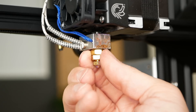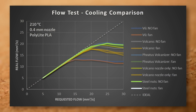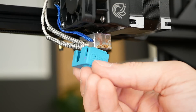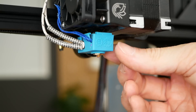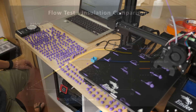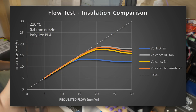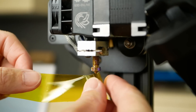The performance drop can be reduced by using regular nuts that add an additional heat transfer path — the copper plated steel nuts still drop 6%, but brass nuts only 3%. What if we insulate the nozzles, which is standard nowadays with all the silicone socks we have for our hotends? On the V6 performance doesn't change. The silicone sock on the large volcano block, though, brings the performance back to the level without part cooling.